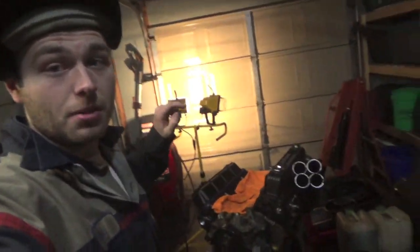Sorry about the fan noise and the welder noise in the background, but we got one little practice TIG weld in. I'm liking how the machine's set up, so now we're gonna flip this engine, and I'm going to TIG weld the bottom of these first, because I wanna grind the tack welds down, so when I TIG weld it, you don't see an ugly bump in the weld. So we're gonna flip the motor up, hook up the welder to it, and start TIG welding it while it's attached to the motor.